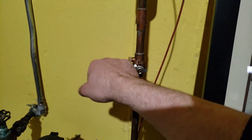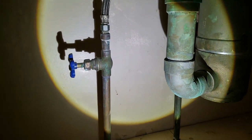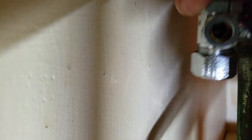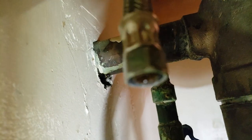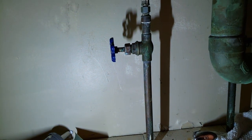No pressure anywhere — excellent. I was going to keep the old valves, but now there's obviously no point. So I'm going to hack it off and attach this new one there with the compression fitting. The old hose there doesn't have a lot of reach — that might be a problem, and it'll have to go all the way down here, so I'm already screwed on that end. I'm going to need to buy a new one. On the other hand, hoses are expensive — at least $15 a pop. I happen to have some spare copper pipe and fittings laying around, so I'm just going to solder extra length pipe where I make the cut.